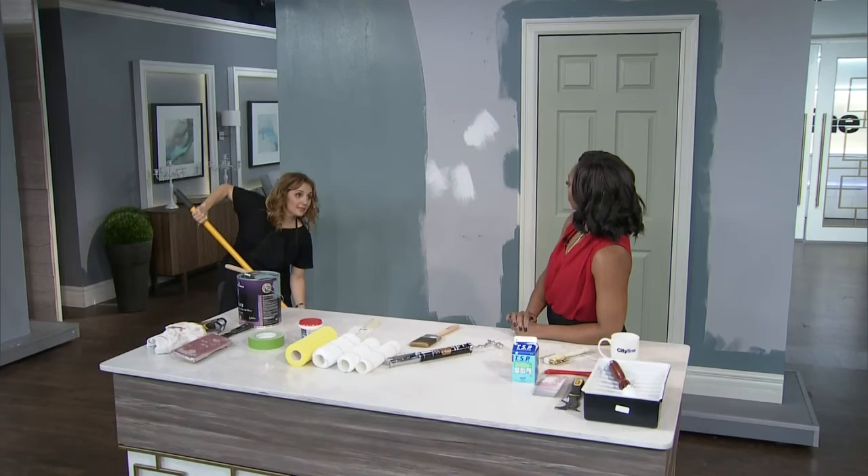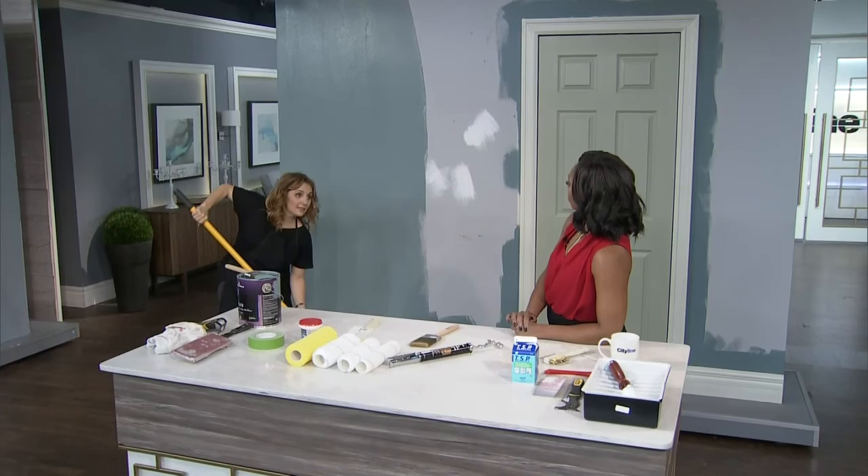That's the technique — you go up and down. Make sure you do all the prep and this is going to go so much smoother. With the trim already done and the color cut in, you can go all the way around the house, do all your cutting in, and then get to your rolling and you're done.